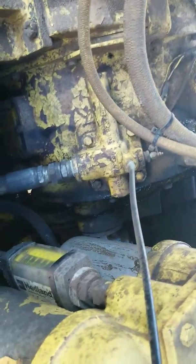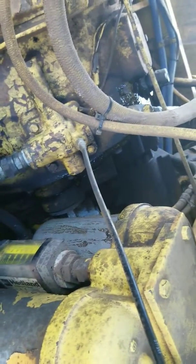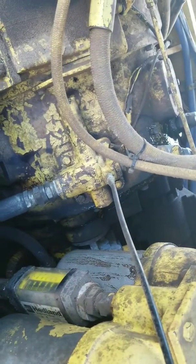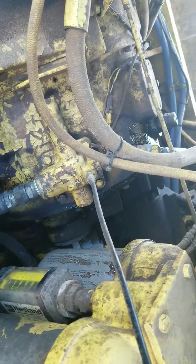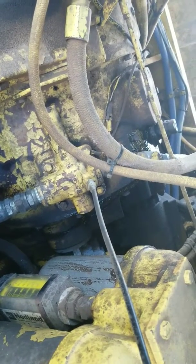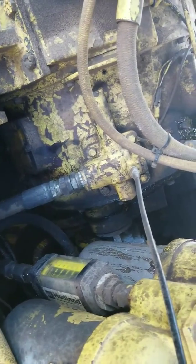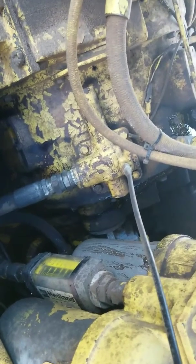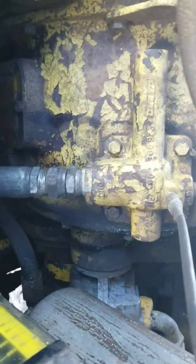I've got a flow meter set up out of my pump — that's a brand new pump I just put on this machine. I wasn't getting the flow I was supposed to have because an aftermarket pump I bought was misadvertised. It was supposed to be a 31-gallon-per-minute pump, but due to its displacement it was nowhere near that. I swapped it out with a hydraulic pump off my 55B that had the right displacement, and now we've got 31 gallons a minute, a little more actually.